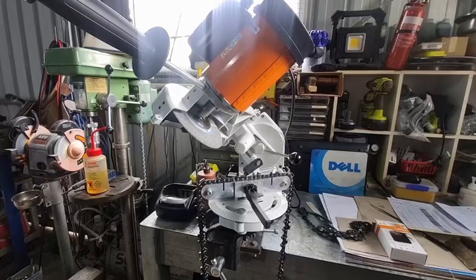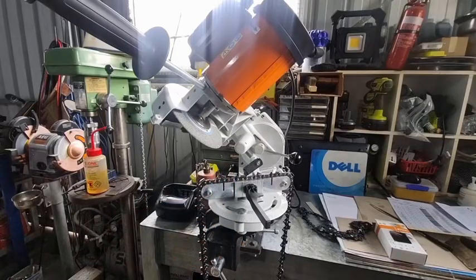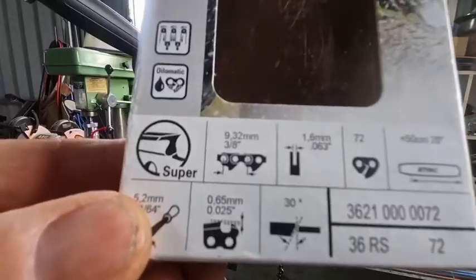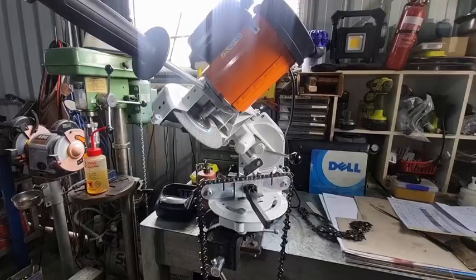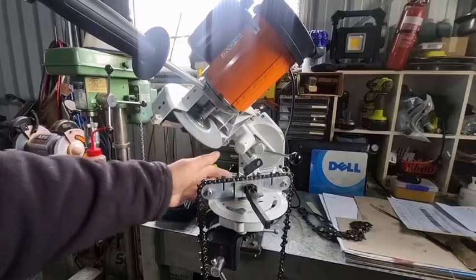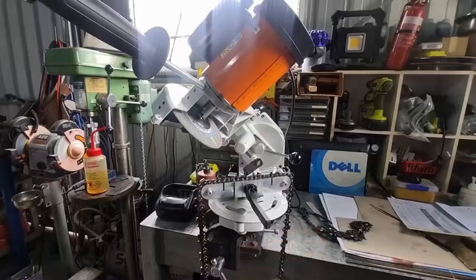I'm going to show you how to best set this up and how it works and how it really follows the factory angles. This is a brand new Stihl RS chain — I always like to keep a brand new one because it acts as a bit of a template. That's the Stihl RS Rapid Super, and for semi chisel and full chisel, even for Picco chains — 3/8 low profile, 0.325, 3/8 standard, 404 — it uses 40 degrees on the head, which is the top plate cutting angle. The vice uses minus 15 and positive 15. The top plate, which is the C scale, uses 30 degrees left and 30 degrees right for just about every single chain, except tungsten carbide and Rapid Hexa, which are different.